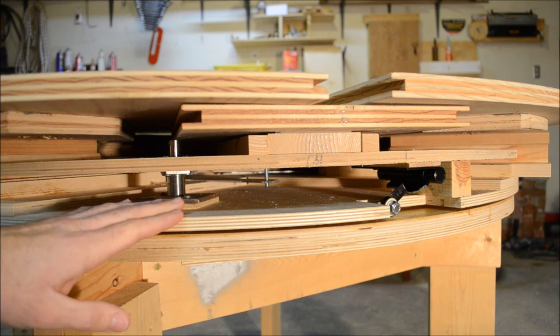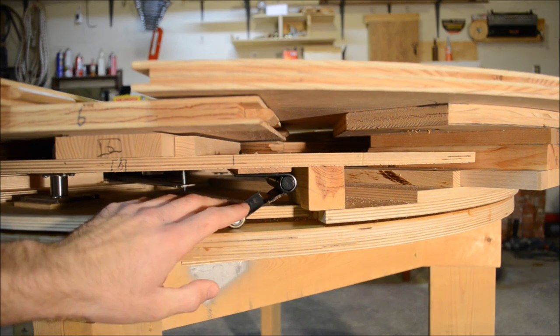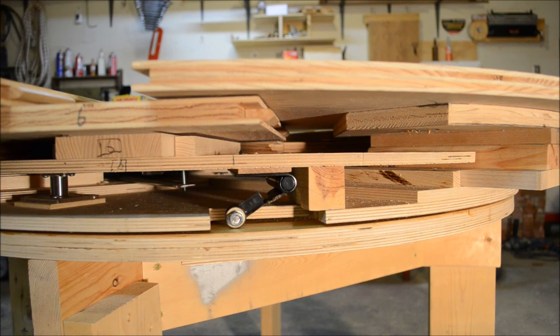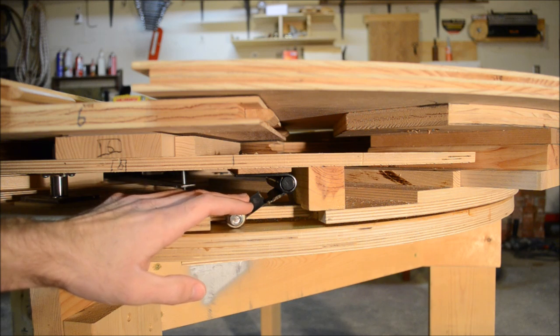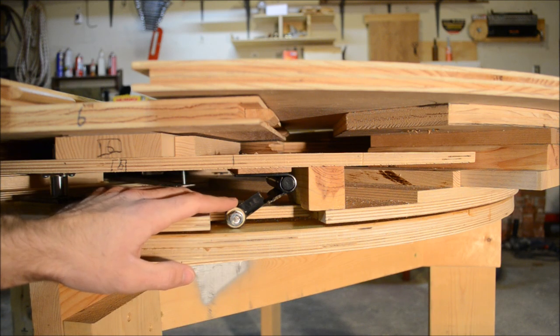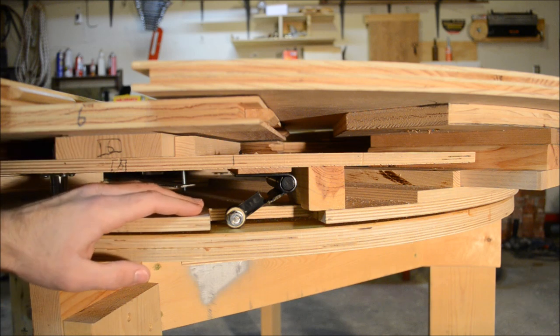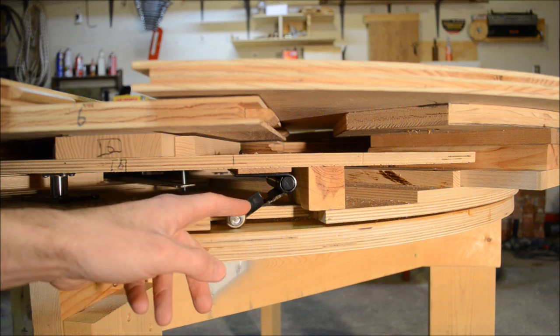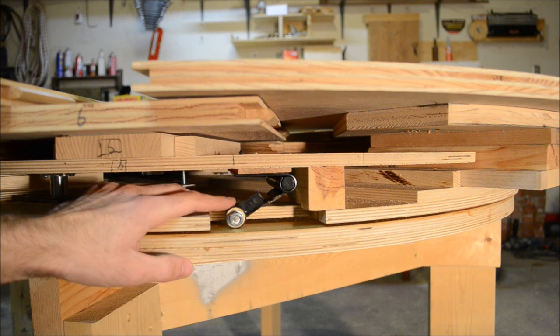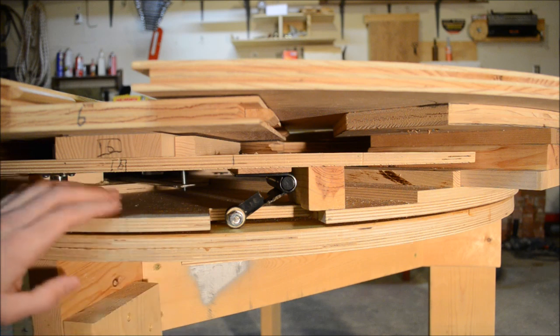You can see the very bottom of the bolt there. As we continue to rotate, you can see these retractable rollers — these are spring loaded. The purpose of that roller is to flip down into a space and then lift it up once the table gets fully expanded. The reason I went with retracting instead of fixed is that if these rollers were fixed, that wheel would have to be down here, which means the support layer can't be there. There are four of these lifting rollers: two on the outside and two further in so they don't interfere with each other. Having slots that go most of the way around the circle would make it quite a bit weaker. So I came up with this retracting system — you need this support level to be as strong as possible, as far out as possible, to maintain the table stiffness.